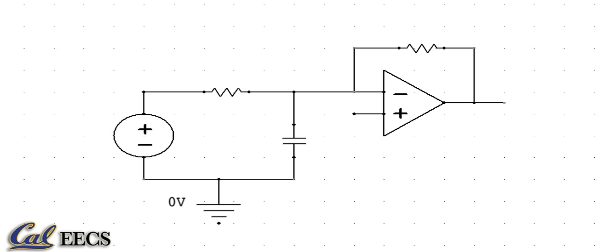For example, if this voltage source is 5 volts, then this node is plus 5 volts from the ground. If we represented the voltage at this node by a variable name, then we would draw it on the diagram either like this or like this, to show explicitly that this voltage's value is relative to the ground.